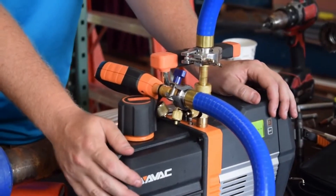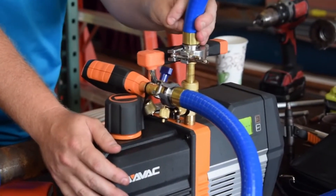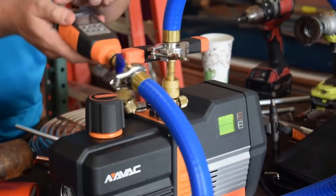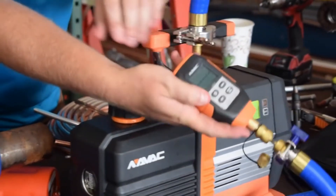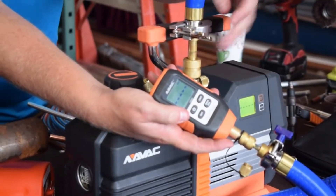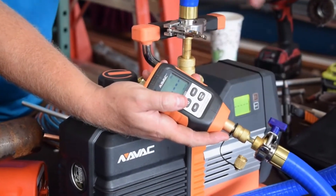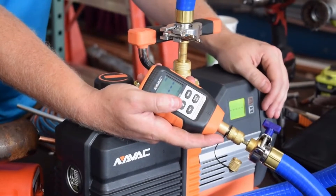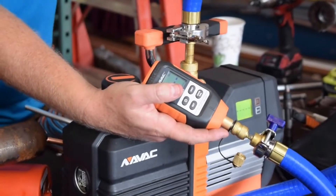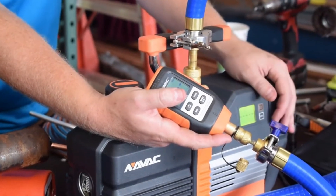The other thing it does is help you see what type of pressure drop you have across your hose rig. If you're using quarter-inch hoses, pulling through Schrader cores, or pulling through your manifold, you're going to see a huge difference in microns at the system versus what you see at the pump. I'm going to show you that these two gauges read very similar because of the large diameter of the True Blue hose. To get the full capacity out of the NRP8DI, you want to use large diameter hoses like the AccuTools True Blue hoses.